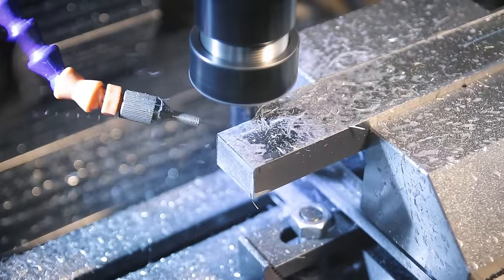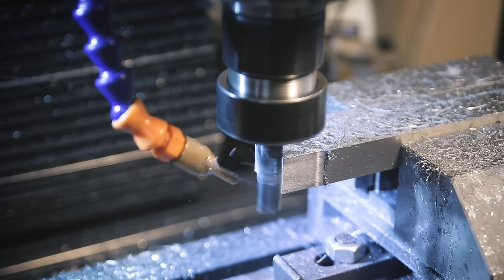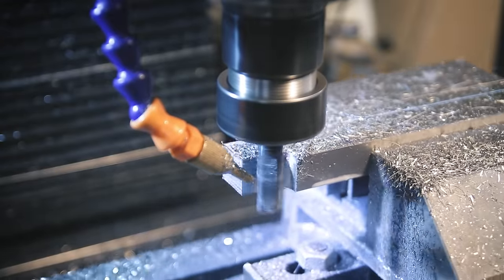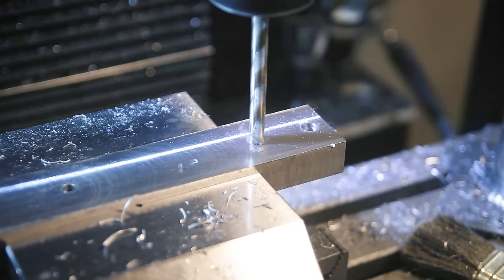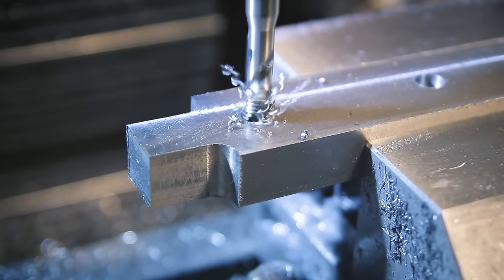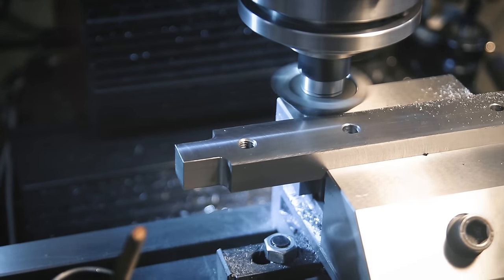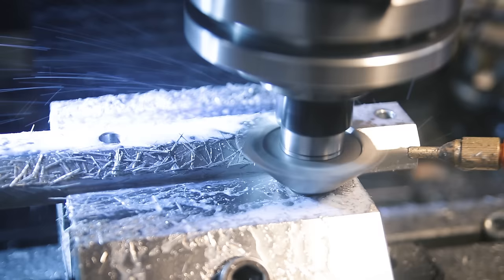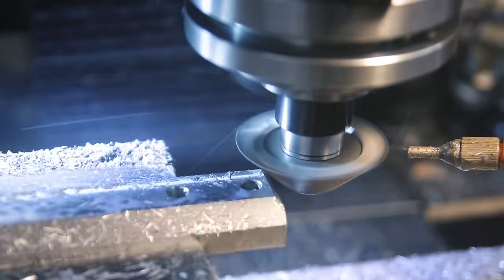As I was doing these cutouts I realized I must have smoked this cheap carbide end mill when I was building the last part, so that's why it's screeching and leaving a bad finish - but it's nothing some Scotch-Brite won't fix in this case. Here's that angled cutter again. This is actually a 45 degree dovetail cutter - not really meant for cutting chamfers - so I'm actually using it upside down here, which means I also have to run the mill in reverse. But it's what I had, and it came in really handy for these parts.